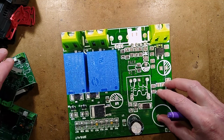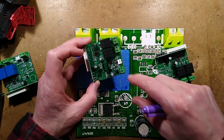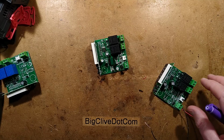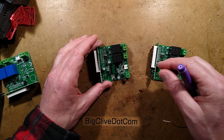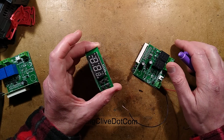Not really much else to say. Not happy at the separation on the mains to the thermistor. I don't know if that's a huge problem or not. It means that the thermistor cable, I mean, it's not directly connected to the mains, but the vicinity of that could cause problems with humidity and tracking and stuff like that, I suppose, really. Although nothing should really be referenced to ground.